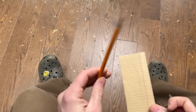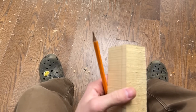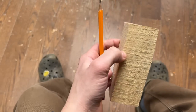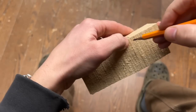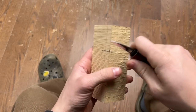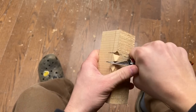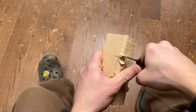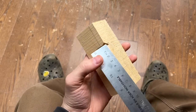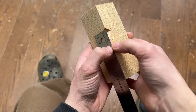I've got a pencil and a little ruler nearby. To start this one, I want to come down about an inch and a half from the top. The first thing I want to do is just make a stop cut right at that inch and a half mark, coming in to a pretty decent depth. Now from this inch and a half line, I'm going to come down about a full inch, and that's going to give me the bottom of my nose.